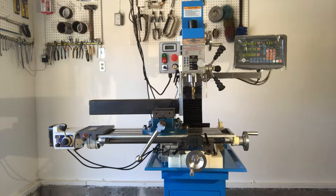Another thing I learned was that the t-nuts that come with this mill are too large, so when you go to mount your bench vise you need smaller t-nuts. I bought a 52-piece clamping kit at the same time I bought this mill, and that included the correct t-nuts, which happened to be half-inch. The slots in the table are 12 millimeter t-slots but you can use half-inch t-nuts, and you'll need three-eighths inch hardware — standard, not metric. So I found myself at the hardware store buying three-eighths bolts and washers.